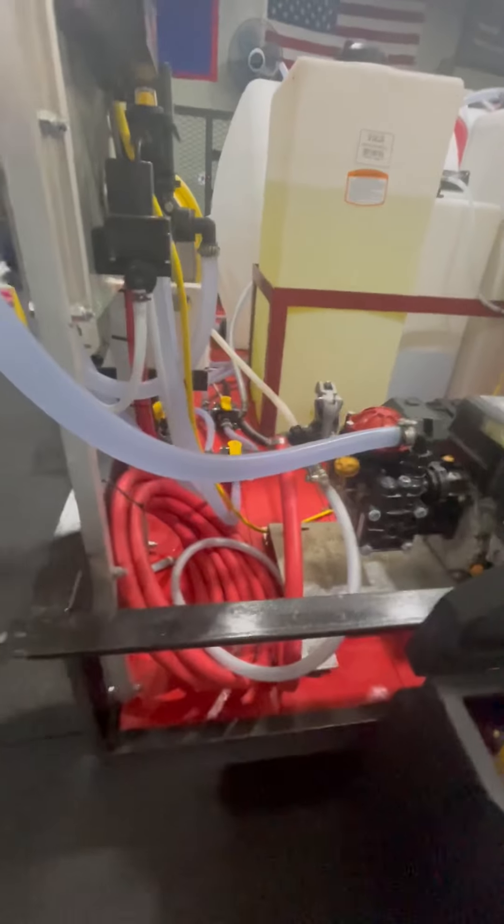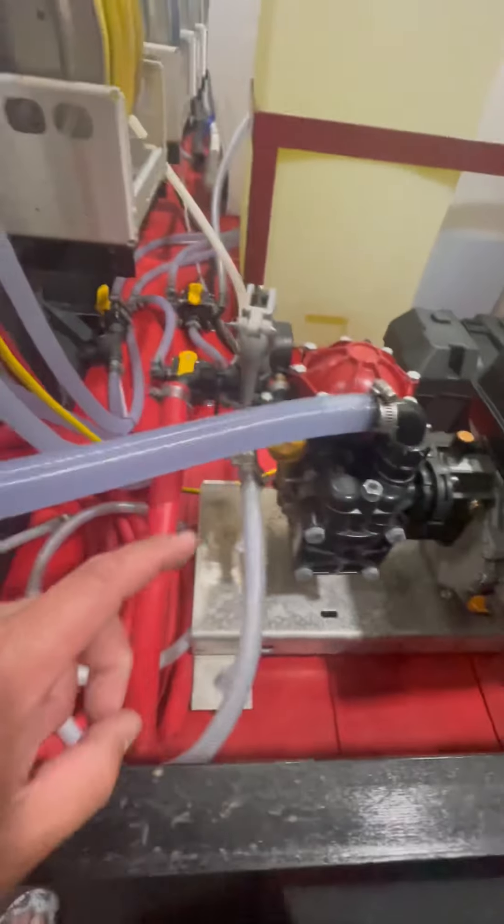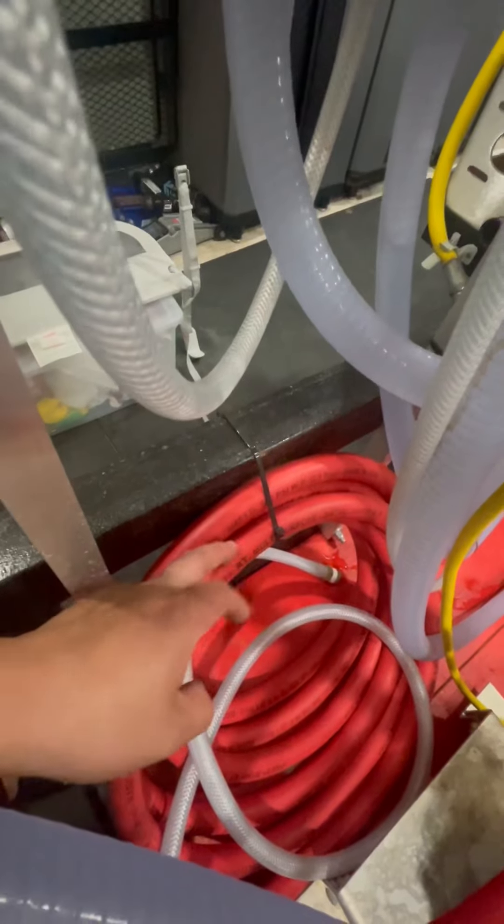If you have any more questions, hopefully that's easy enough. If you're having a hard time priming, you have a good chance by just putting a water hose through the pump system and flowing through there. But the biggest thing is making sure you prime some of that air out of the bypass hose.